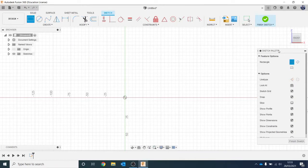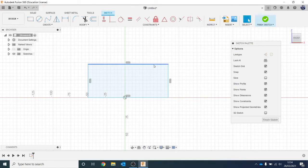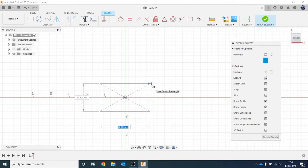Just be aware, I haven't gone over this yet in any of the previous videos - there are a few different ways you can draw rectangles. Normally it does corner to corner, so you click one corner and pick the other. The other really useful way is Center Rectangle, which lets you find the middle and draw outwards. For what we want, that's going to be a lot easier and more accurate. So we're going to start with a center rectangle and do 50mm, then hit Tab on the keyboard to switch to the other dimension, type 2, and hit Enter.